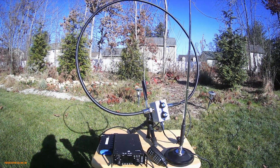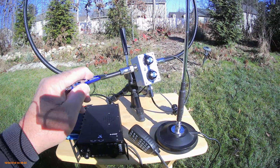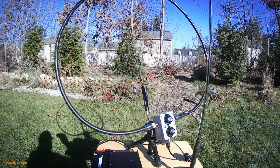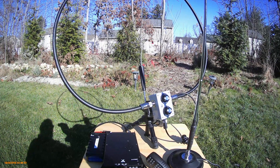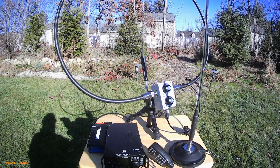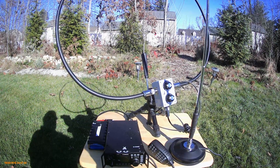The three types of antennas I'm going to be taking with me. First, this mag-loop antenna that you see in front of me. It has a small diameter — it's only 70 centimeters across — and this is designed to work both 10 to 20 meters and 40 meters. I plan on taking this and seeing what kind of QRP work I can do. It can only take 10 watts.